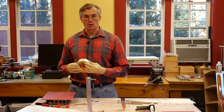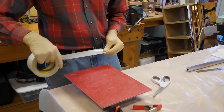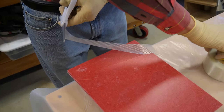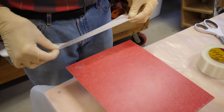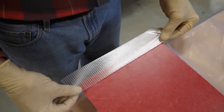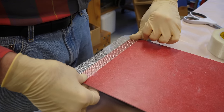It takes advantage of very strong two-dimensional fiberglass reinforced tape. I'm going to take a piece of this tape and cut off a generous piece that's at least as wide as this material. Then I'm going to apply the tape to this surface here, slightly less than halfway to allow for the thickness of the material, and press it down to get a good attachment. It doesn't matter that I have extra material on the sides — we'll cut that off if we don't want it.